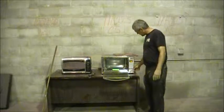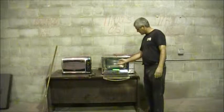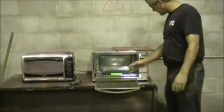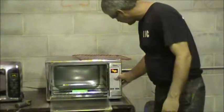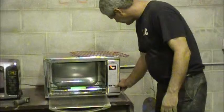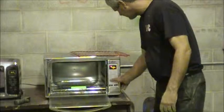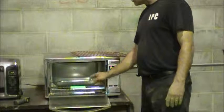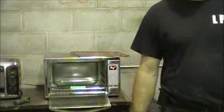You guys remember when you're dehydrating, you don't want the part metal temperature to get to the point where the powder goes into gel state, so keep it away from the electric elements inside there. We're going to turn this on, warm it up, and let it run for about 10 minutes so the part can dehydrate. We don't want to get it too close into the oven right now.